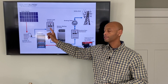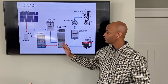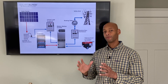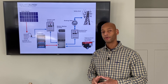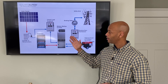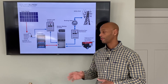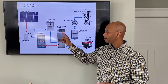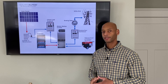We'll deliver your grid-tie solar into the critical loads panel, and we will also connect your battery backup inverter. It could be an integrated unit where the battery and inverter are in one appliance, like the Tesla Powerwall for example. Or, like in this example using the Outback Radian, you have the inverter and then a separate battery rack where the batteries are stored. The output power from your battery hybrid inverter will also be delivered to your critical loads panel.